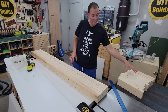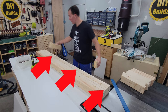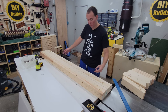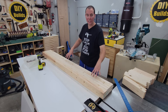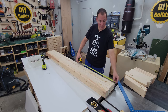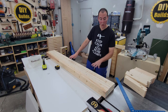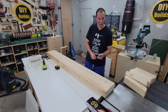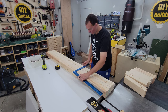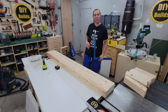I've got all my brace pieces over here. These are simply going to go between a front and back stretcher — one on each end and two in the middle. Because these are 6-foot, I'm going to space them from the end at 2 feet. I'm just going to mark out my 2-foot mark on my first board, and then with all of these butted up against the end and my square, making sure they're not twisted, I can simply drop my square across and mark them all at once.